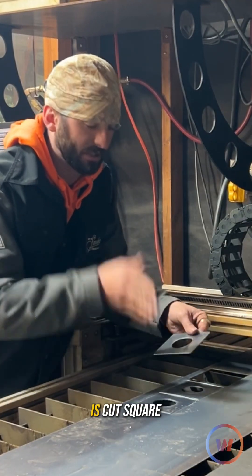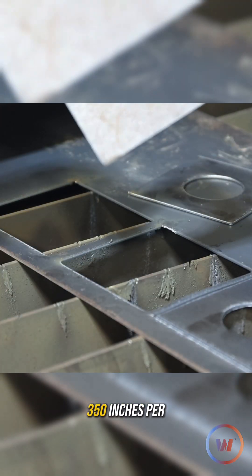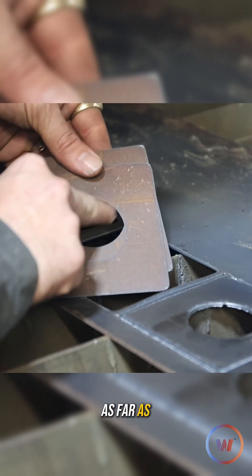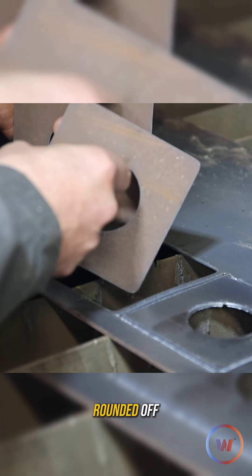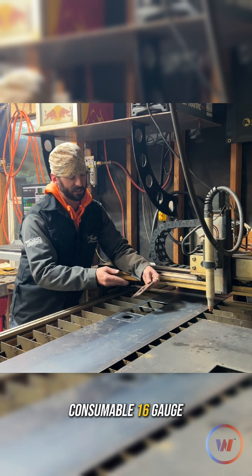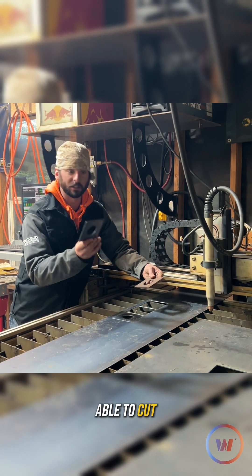It's hard to tell if anything is cut square on 16 gauge because it's just so thin. This was the 350 inches per minute — I'd say there's significantly less dross on there. However, as far as the right angle goes, I feel like these corners got a little bit rounded off a little bit more. Looks like we could potentially pump up the numbers. Looking at a 45 amp consumable on 16 gauge and what the cut chart is telling me, I'm able to go almost 100 inches a minute more and still be able to cut this part. So these are the things that you need to consider.